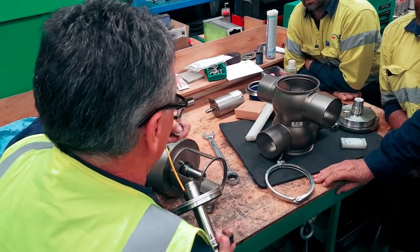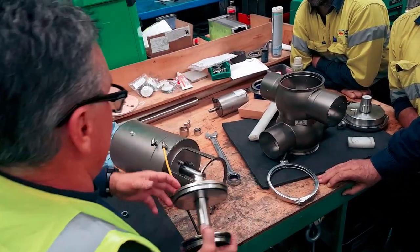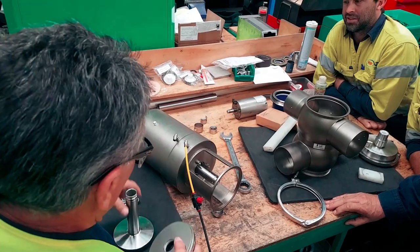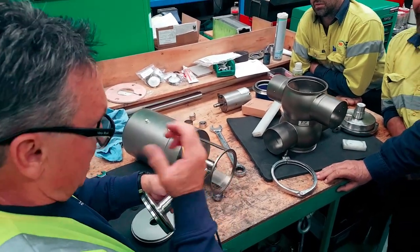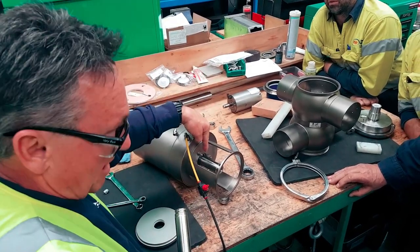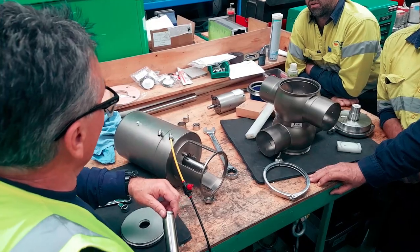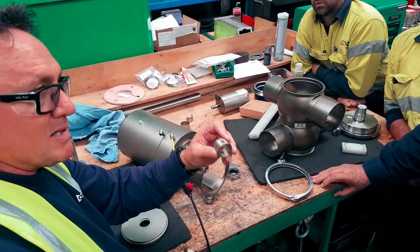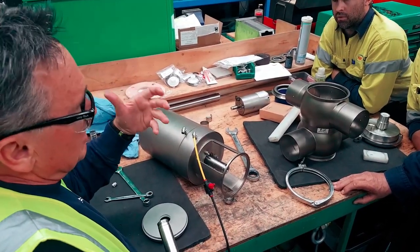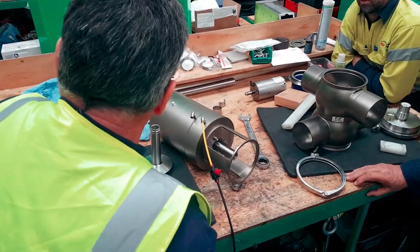One of the big things is you end up putting all the valve back together again and leave your apron behind. If you get the small O-rings in there on the kit, put them in, it doesn't hurt. It's up to you. But unless you've got a flush hose in there, they're not necessary. You're not going to cause any damage. Sometimes it helps keep that little coupling in place for you. But it's very important when we line these back up that we do it correctly, because there's a lot of stuff that can go on in here.